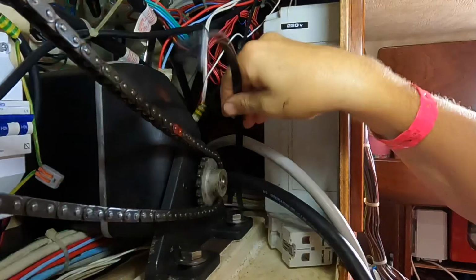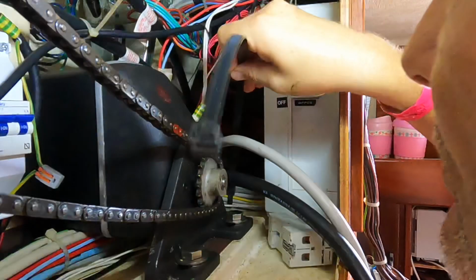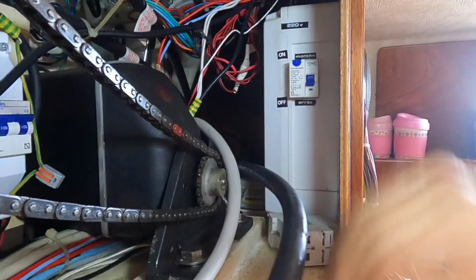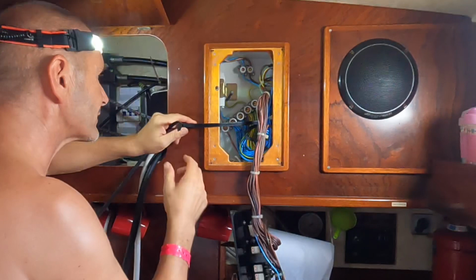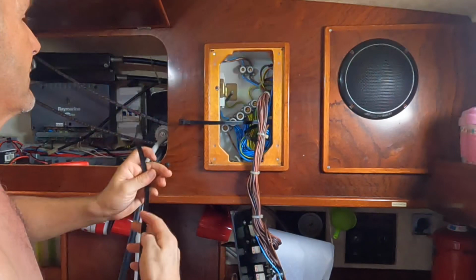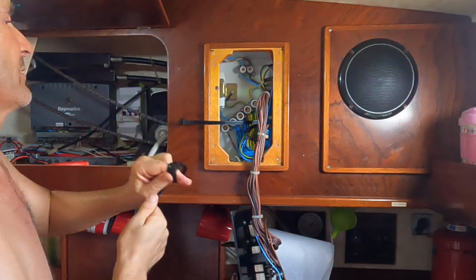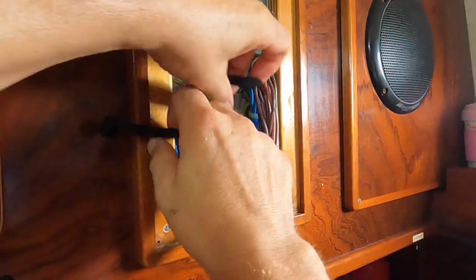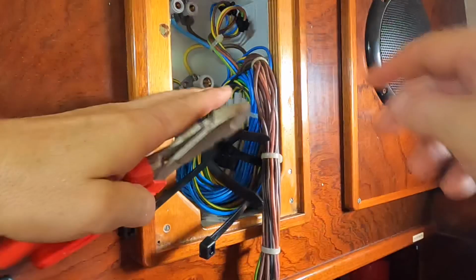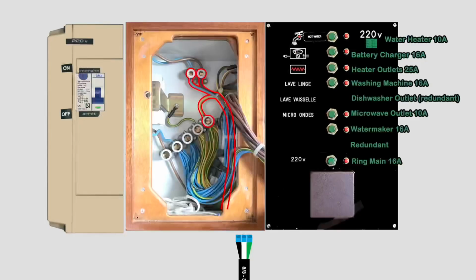So I just want to get another one in place so I don't lose that entire bundle. So many mousing lines down there from previous jobs. Got it. I've got these cable ties in here, but I don't want them to spring apart, otherwise I'll never get them back together. So I'm going to try to get these other cable ties ready to just deploy in their place. But it's in a really tight corner, so the best way I can think of doing that is to pre-bend them, so they kind of go around the back of the loom. Top one. So these are the looms I want to cut, and these are the ones I'm going to put in their place. The wire that I need is right behind there.